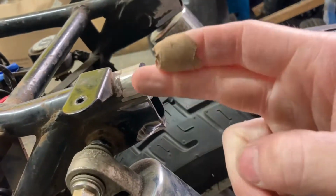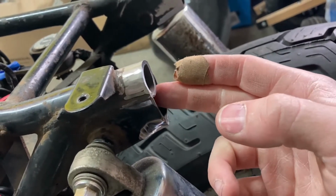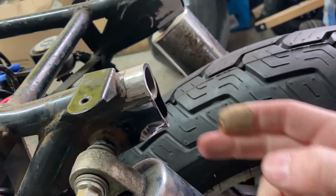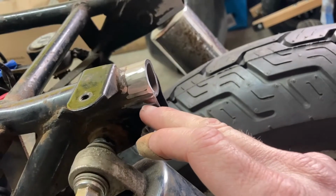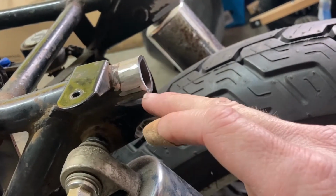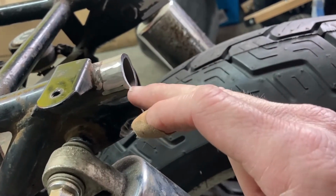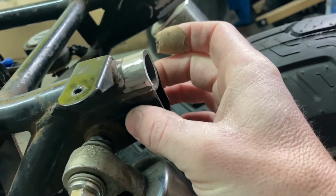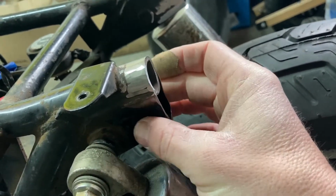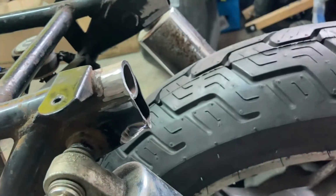When I go to weld this tube, because of this piece here, I'm not going to be able to weld the bottom side of the tube here. So I'm thinking that I need to probably cut this back some more in order to be able to get all the way under there with the welder and fully weld the bottom of that tube in there. And then later on, we can worry about extending this kind of gusset or support, I guess, out further. So we're gonna do that.